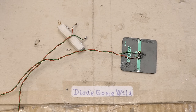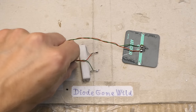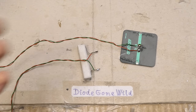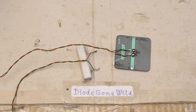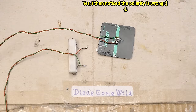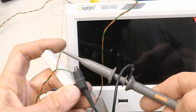The warm-up can be recorded. I'm connecting a solar panel to a resistor — about 10 ohms, way bigger than necessary — and using a slow-rolling oscilloscope to measure the voltage on the resistor, which loads it to a small fraction of its open-circuit voltage. So the oscilloscope senses the current, not the voltage, because current goes linearly up with illumination. The voltage goes up more logarithmically, so to use a solar panel as a linear light sensor you must measure the current, loading with quite low impedance.